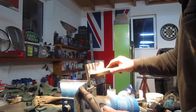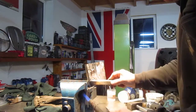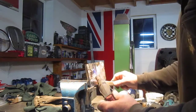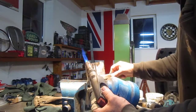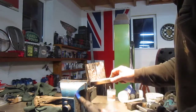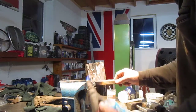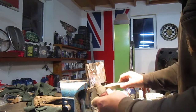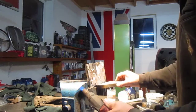You can see there, see how it's sitting quite nice. Just heat it enough so you can see it. And what I've learnt with it is you don't need to flatten it out too much, but what you need to do is definitely push it into whatever it is you're doing. You can see there how it's building up almost like a dam. And this is what I'm talking about, this judgment call about where you should be with it. So you heat it enough so it's not flowing, but also get it in so you can move it. It should be like, say, warm butter, but not runny.